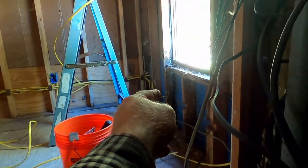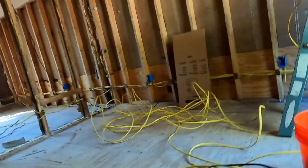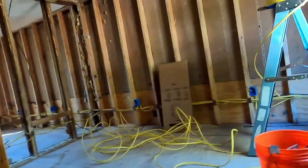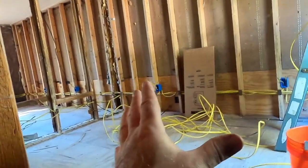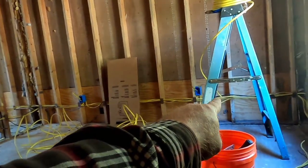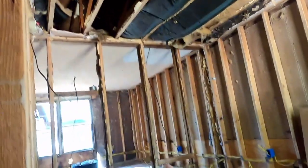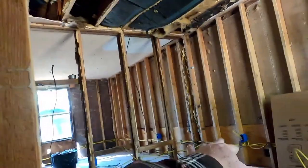We'll have one around this corner, but not necessarily under the window. There'll be one in this wall here. There's already one on the other side and another one over here. So there's gonna be more sockets. These two rooms are gonna be on 20 amps by themselves. And I have them isolated on that. There's one black wire that you see. It's gonna feed the 15 amp that goes up and does the lights. That way the lights are separate from the bedroom.